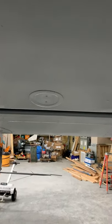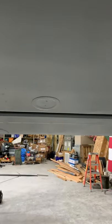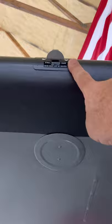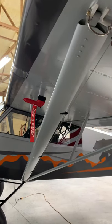On that one, we really don't even need to put a cover on it right now. If I'm not going to use them, I'll just not cut them out — I'll just make sure I paint a cover so if you ever have to access it, when you do your first conditional inspection, you'll have to cut it out anyway. Up here on the left wing, we do have the stall warning indicator, so we're going to have this round grommet right behind where the stall warning horn is going so we can access it. It's going to be on the forward side of the spar. This one is on the back side, working the cables back down to that side. Those are all of the inspection covers — you can use this along with the drawing to verify.